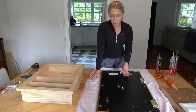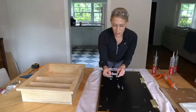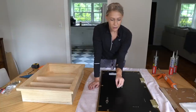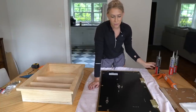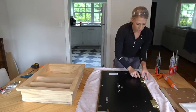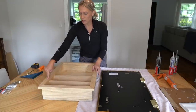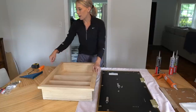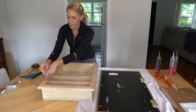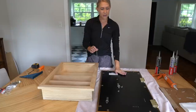I'm kind of changing directions here with the door for the medicine cabinet — I think I can attach the hinges directly to the mirror. The mirror came with these picture hanging brackets attached to the back with tiny screws, so I'm going to use the same screws along with some construction adhesive to hold my hinges in place. I have two hinges already and I'm going to pick up one more for the middle for extra support. One side of the hinge will be attached to the mirror and the other side will be attached to the trim piece. I have super long wood screws that will go through the hinge, through my base trim, and then through the stud in the wall — so the hinge will be extra secure.